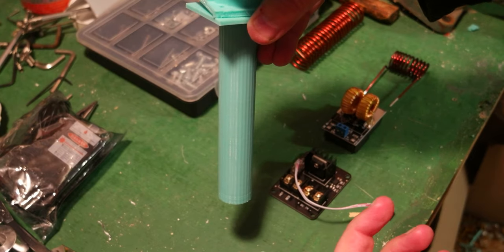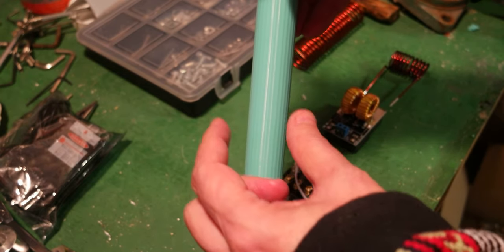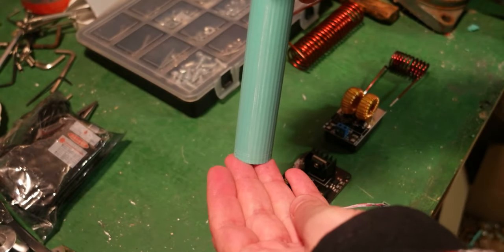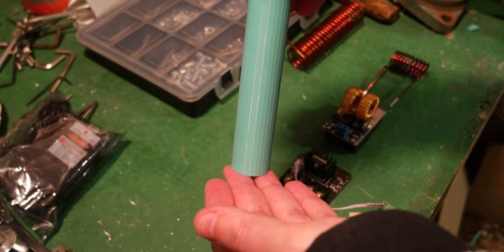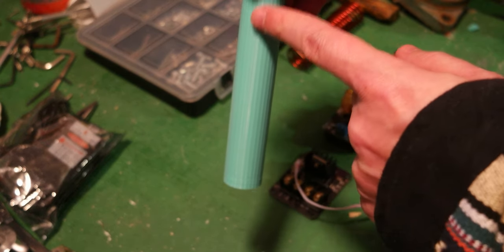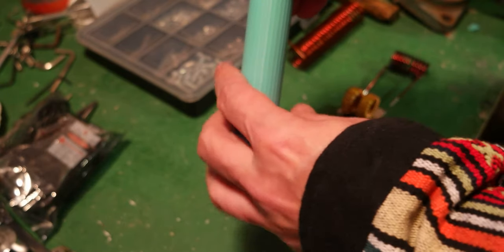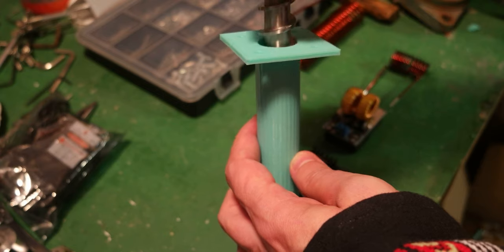How do I melt the pellet? Previously I had an aluminum heater block — much smaller than this setup. The tube went inside the heater block, and there were resistor heaters like normal 3D printer heaters, around 40 or 50 watts. With that setup, I found that the pellet was only melting in the last zone near the tip, but not at the top.